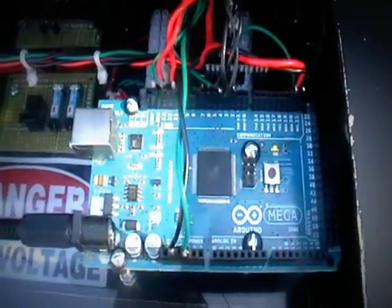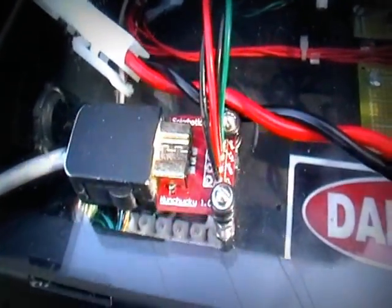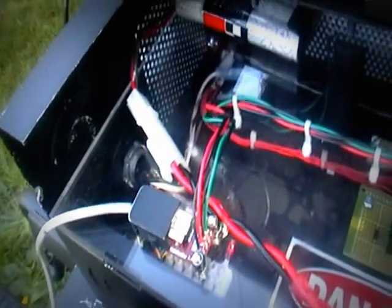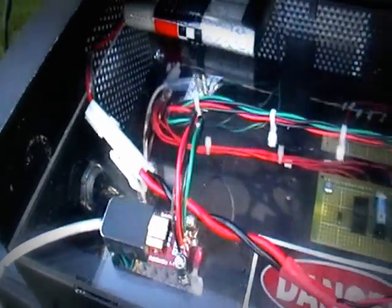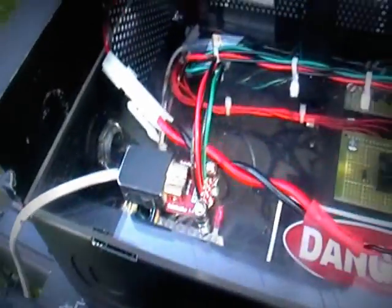It's all controlled by an Arduino Mega. My controller of choice is a Wii Nunchuck — it's just hardwired to the system right now, but eventually this will be wireless using some XBees. The Nunchuck is connected to this little PCB I found online called the Nunchucky. This works really awesome — the Wii Nunchuck plugs right into it and locks in place. It's got two screw holes for mounting and works beautifully for this project. I've seen these really thin, linear Nunchuck adapters that plug into Arduinos, but you can't really mount them anywhere. So this has been awesome.